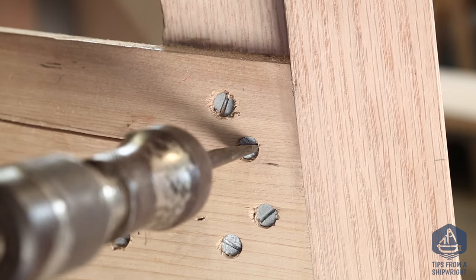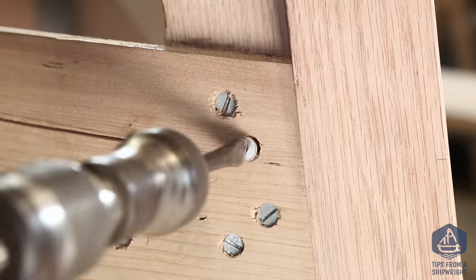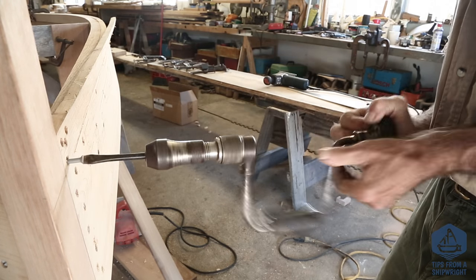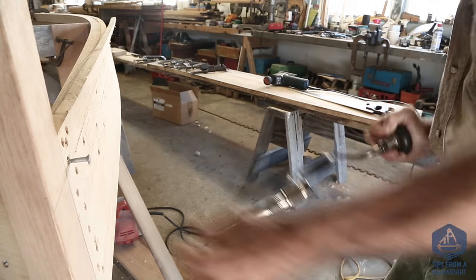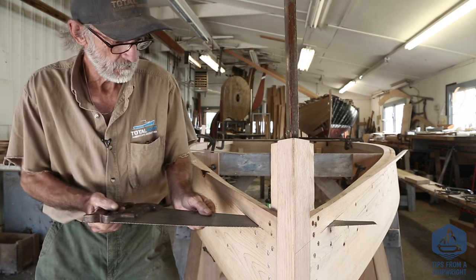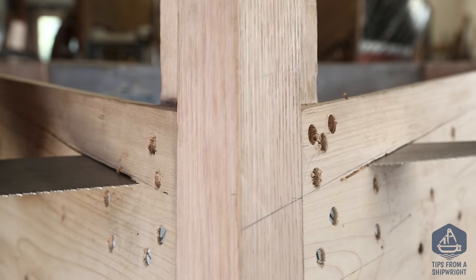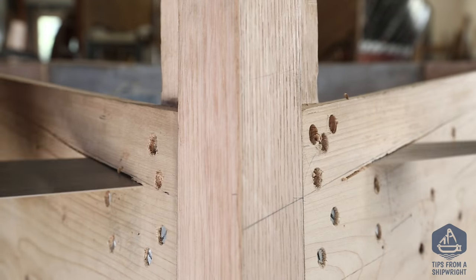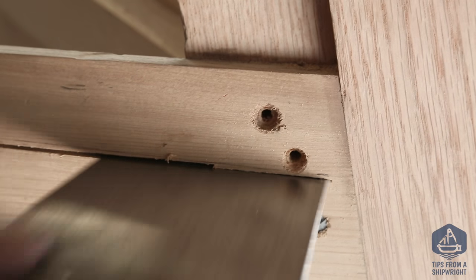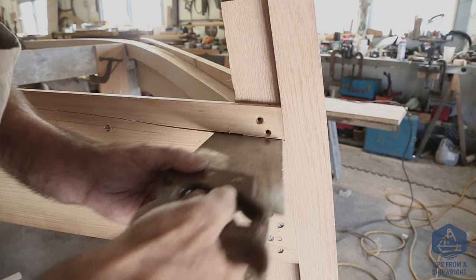I'm using a bit brace here to remove the screws that aren't necessary — they were just in there to stabilize that joint between the side plank and the stem so when I bent the chines it wouldn't pop the side planks off the stem. Then I'm going to slip a handsaw into the two cuts I've just made and saw right along parallel, directly athwartships, until I get very close to the rabbet line. Then I'll change the angle of the handsaw and saw along until the port side is ready to remove.